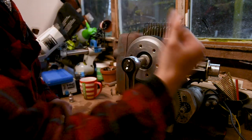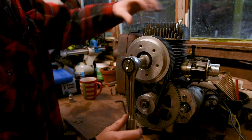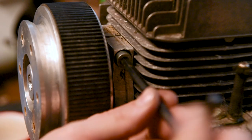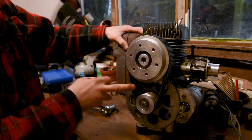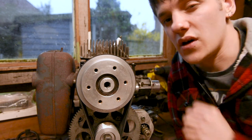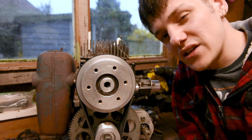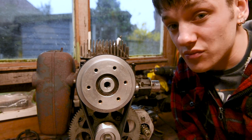Other machines you'll need to hold and then maybe get a friend, or be a bit ambidextrous, and then go and tighten that pinch bolt as well. I'm fairly happy that that's staying in place, so I'm going to take my other allen key and tighten up that pinch bolt. Once that's tightened up, give that a quick check, and once you're happy, take it out for a spin. It's probably good practice to put a little bit of Loctite on this pinch bolt — that way when you're in flight the vibration isn't going to shake it loose and you're going to have to make an emergency landing in a field, which none of us really want. So put a bit of Loctite on that bolt and you should be golden.